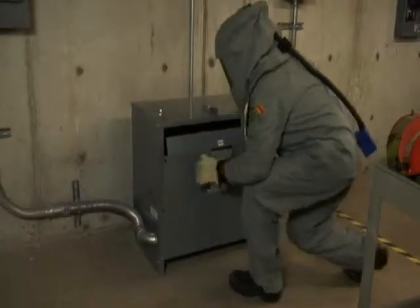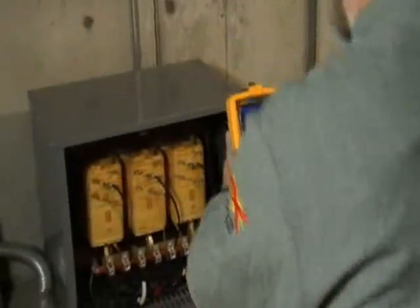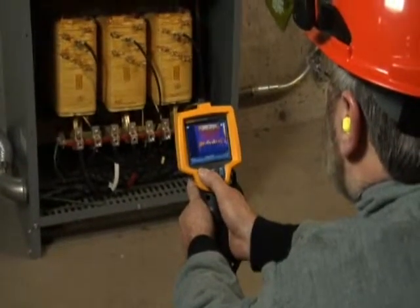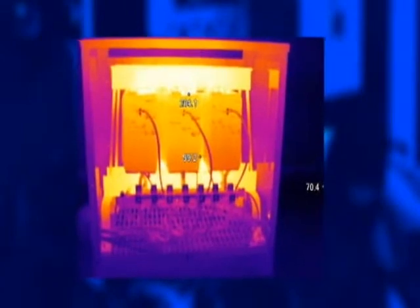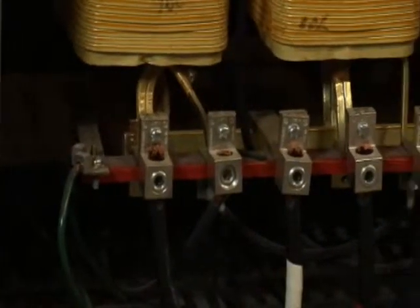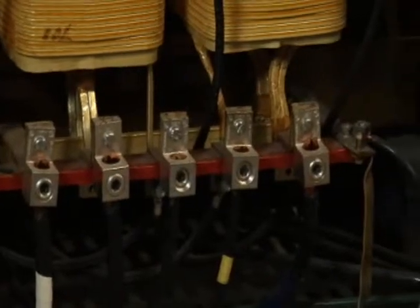You should scan the transformer with either a thermal imager or an infrared thermometer. That requires taking off the cover. Determine the hazard risk category for the job, either from the arc flash label or, if not present, from the tables in NFPA 70E. Compare the temperatures of similar components, such as terminations and coils, to one another. A higher temperature on one phase may indicate unbalance. A higher temperature on the neutral termination may indicate the presence of harmonics. If the temperatures you read throughout the transformer are substantially higher than expected and the unit isn't in direct sun, then you've got a problem with overloading and cooling. Another thing to look for in a thermal scan is loose connections. Long-term vibration can loosen connections, and this can cause both overheating and sometimes excessive buzzing.